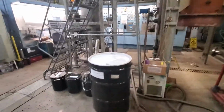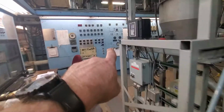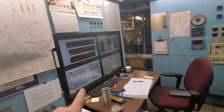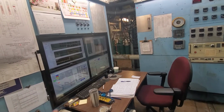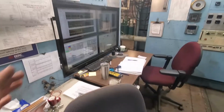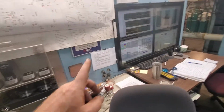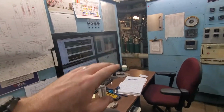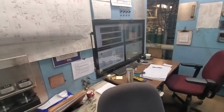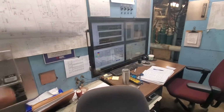The other thing the engineer is going to do is double check all the samples are there. Put up new log sheets for the next run. Stop data logging. Change the file name. Start data logging. Copy the data using that USB drive. So in the morning, all the weights have been recorded, all the log sheets are in the folder, and we're logging on the correct data file for the next day. The old data file is on that thumb drive in the morning. Mr. Musich will come and get it. So in a nutshell, that's what you're going to do. Again, follow the maintenance list.